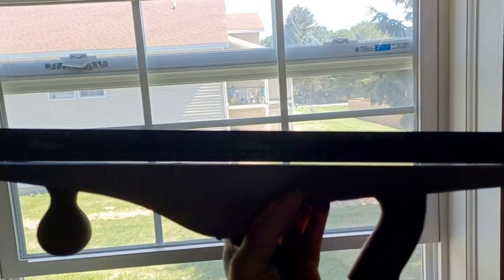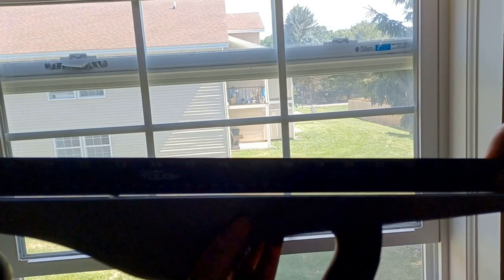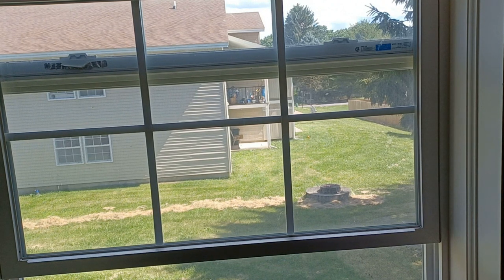So I started going through some troubleshooting videos, and just one thing they said to look at — that, my friends, is way too much of an arch and gap on this thing, all the way down to the end. There's no way that will ever plane anything with that much of a gap, unless it's lapped down or re-leveled on a machine or something.